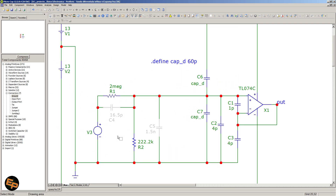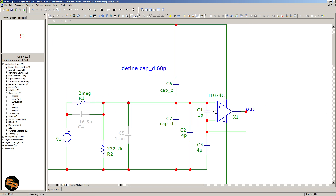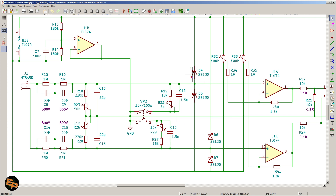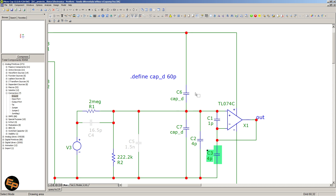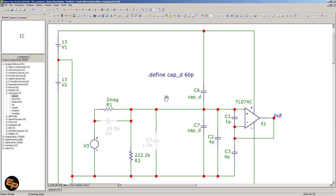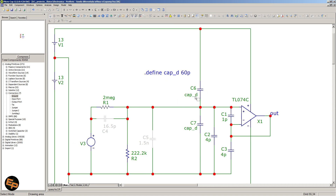If we run an AC analysis from 1 Hz up to 1 megahertz and look at the output of the op-amp, surprise surprise — I don't go anywhere near 1 megahertz. An attenuation of 10 means minus 20 decibels. So we see a flat line of minus 20 decibels — exactly what we want — that goes up to about 2 kilohertz. From 2 kilohertz we slowly start to attenuate more, and from maybe 6 or 7 kilohertz we go down at about 20 decibels per decade, which is the usual slope from an RC filter. And we want to get up to 1 megahertz, but at 1 megahertz this circuit has about minus 63 dB attenuation — one to 1000 — which is just not acceptable.